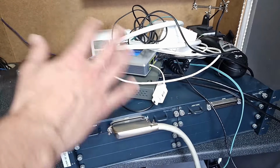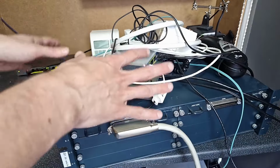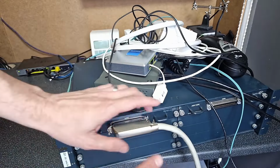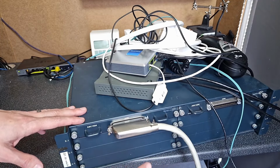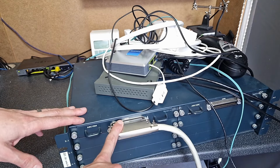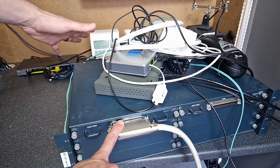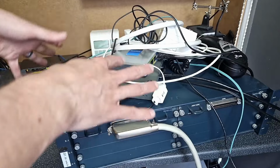This is going to get split out a little bit. It's just I wanted to show the front of this before I spun it around in order to give me the space I need to actually do this. So the MSAN, as I said, is actually sat on the floor just out of view. The feed from the MSAN that's delivering the ADSL signal is coming up through the telco cable and into the front of the ADSL splitter. On the rear of the unit, you have the user port and the CO port, which we'll look at in a bit more detail once I spun this around.